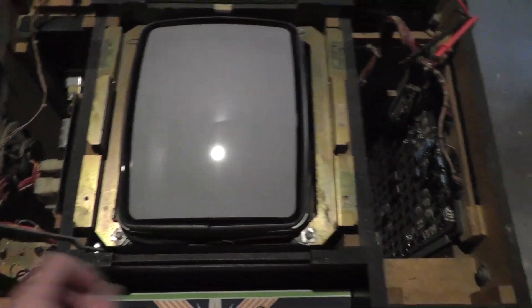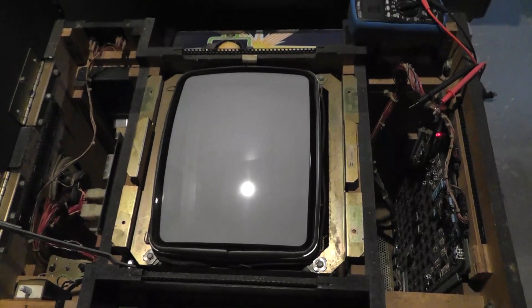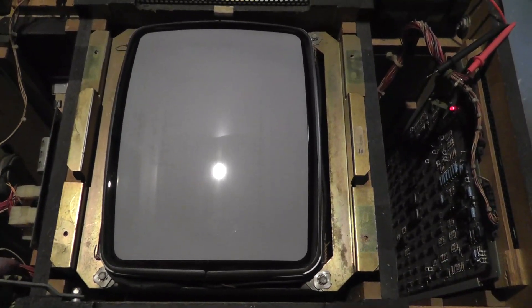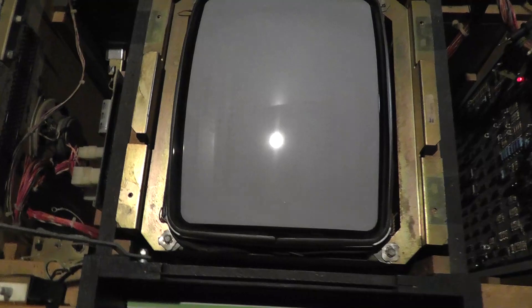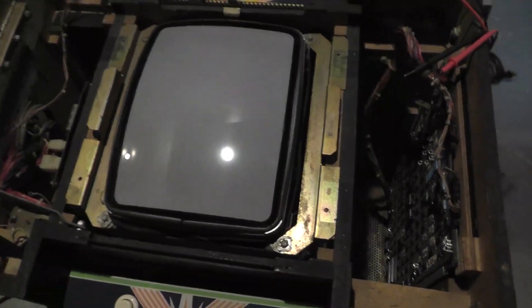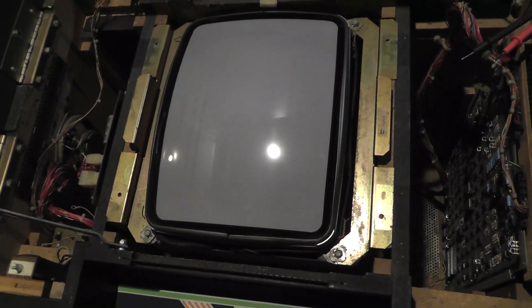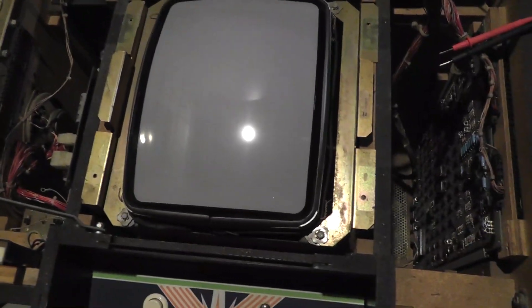Maybe I should just put this back in the cabinet and see. I have the board plugged in and the monitor hooked up. If I turn it on, I still don't see an image. I can coin up — let me hit play. It's definitely playing blind, but no image. No image at all. I don't know what's going on. The monitor is definitely on and I have proper brightness — I had already adjusted it. Let me take the monitor out and test the video continuity to the cable I'm using to connect to the monitor. I think this is going to be a dumb one.